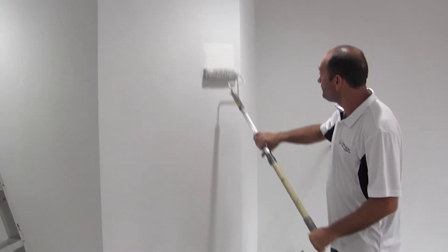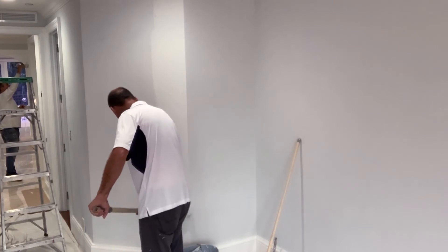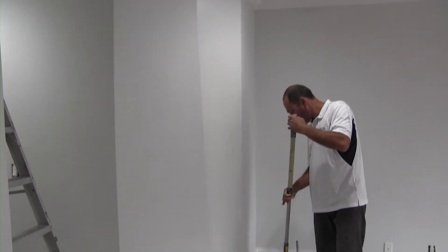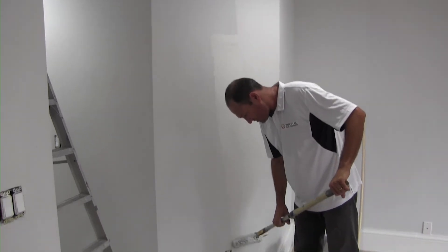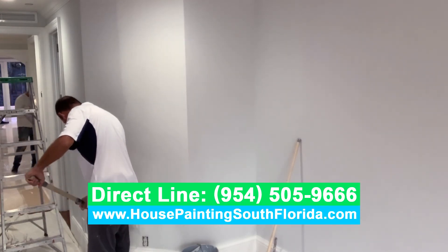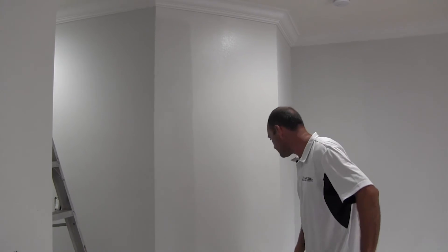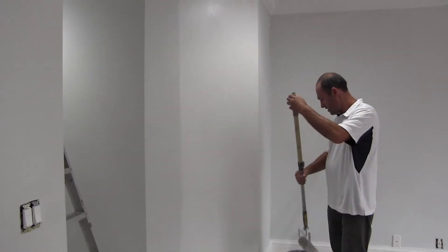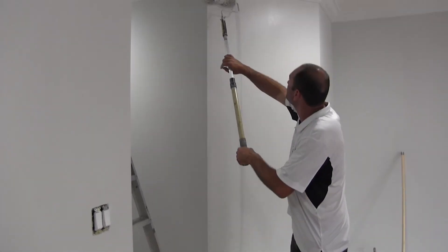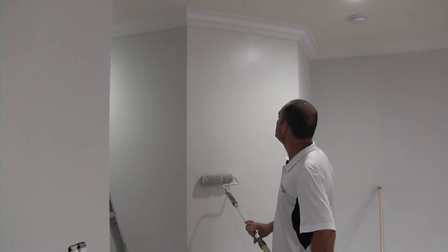Alright, now we're gonna roll. It looks a little different when it's wet, but when it dries it's gonna look the same — we did the color match and patched everything to make sure it matches what the homeowner loved. With this roller, we cut in so we don't need too much texture on the wall. Nice and easy. Look at that guys — looks easy, huh? Beautiful.